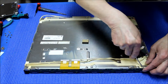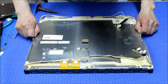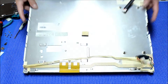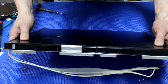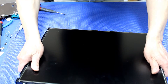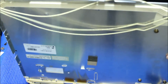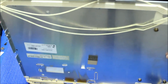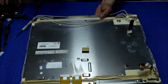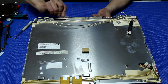So, slowly. The next thing we need to do is pop this back cover out. In order to do so, if you look at this end, we had to cut it off. But when you hold this, be careful — because if you don't hold this glass, the liquid crystal glass will drop off. So just be careful; make sure there's nothing on the table that will chip the screen. What we're going to do is use a blade to cut over this.